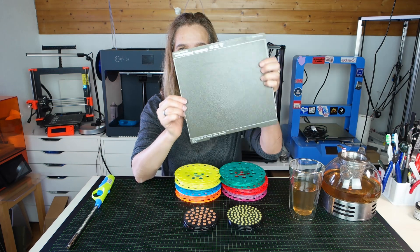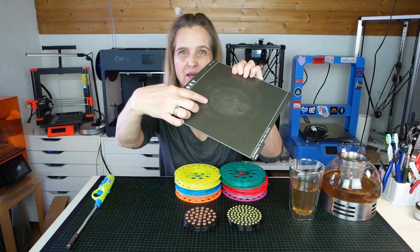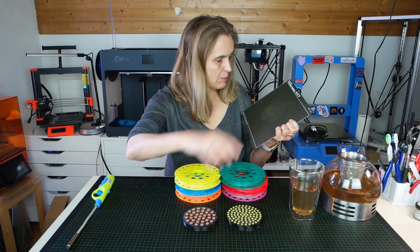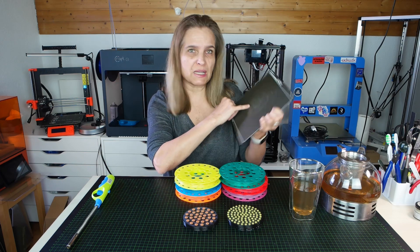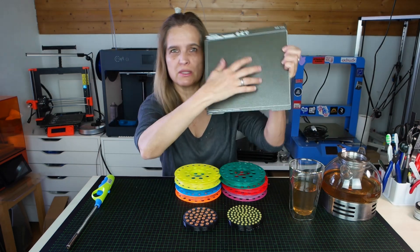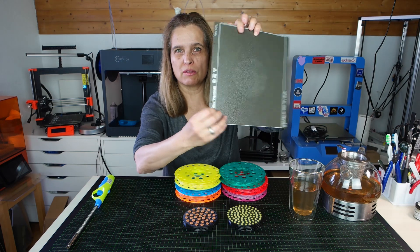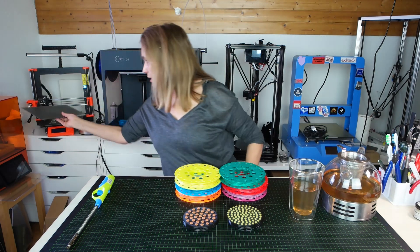I printed this on the Prusa MK3S. What I didn't know in the beginning is that if you print with TPU and always put it on the same area, something happens to the steel plate. I didn't use the soft one — I used the textured one because I really like the bottom to be textured. But something happened — I'll need to look under it with a loupe to see if it's just a crust or if it ripped out some of the PEI coating. You can still use it but it doesn't look nice. I'll use this side for TPU and the other side for PETG or other materials.